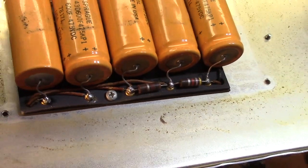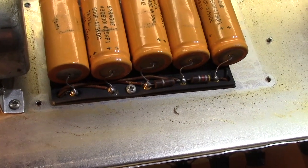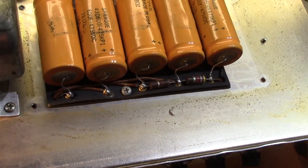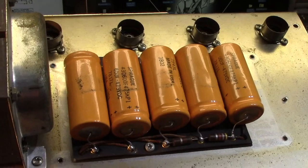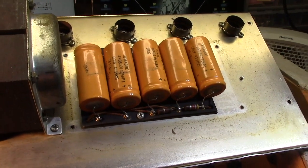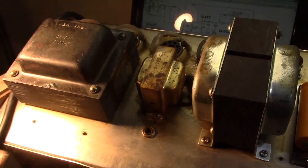You know, good modern replacements, which we're going to use, metal oxide ones, they're cheap. They're cheap. What are you hanging on to those for? They're not really affecting the sound of the amp in any meaningful way, so just pull them out of there. It's much safer. You're going to be able to hammer on it with impunity. And there you go. All right, so that's really some of the most horrifying aspects of what's going on here.